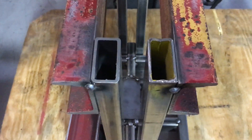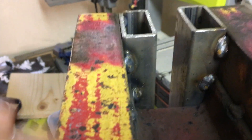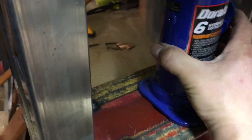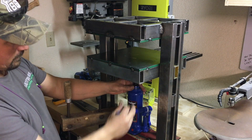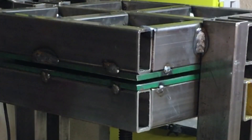With the traveling plate in position, I can weld on my channel. Once the channels are welded to the sides, I added a third piece of channel in the middle, and that gives me the correct spacing along the rails. Now with the press sitting right side up, you can see the channel makes for a great base to install my jack. With all the components in place, I go ahead and give this thing a dry run to make sure that my traveling plate correctly slides up and makes contact with the fixed plate.